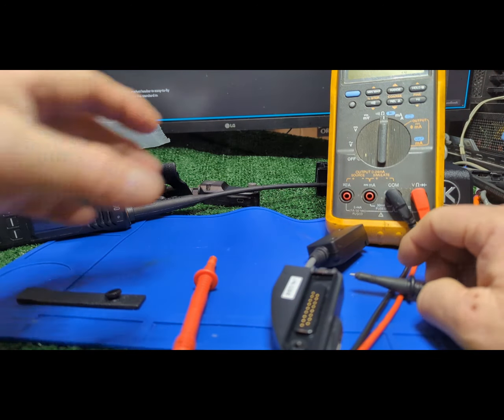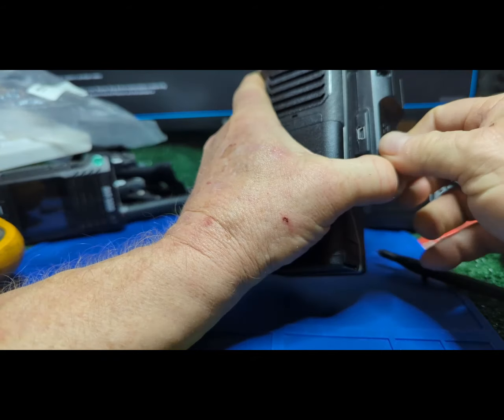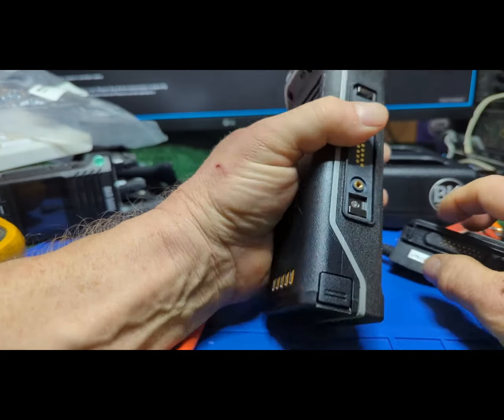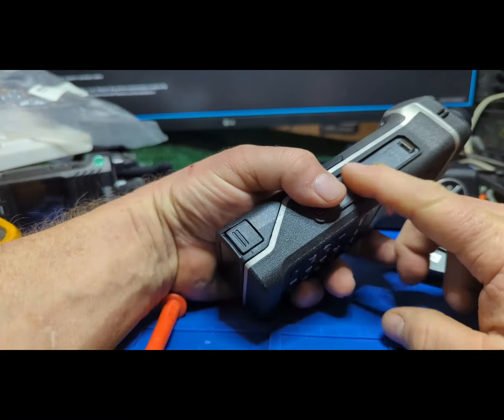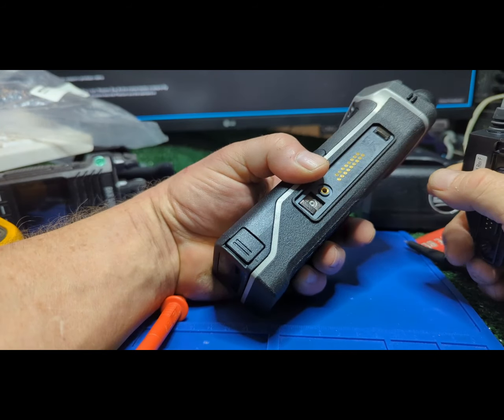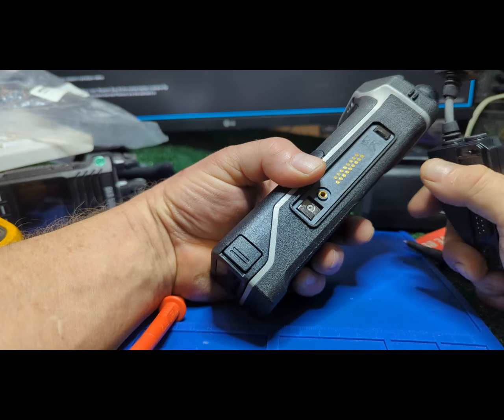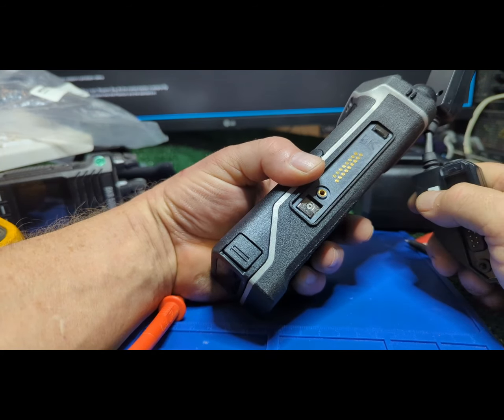I modded all of my dongles, so I don't know if that's been implemented yet, but that's what they said. The reason they do that — it's a good reason actually. If you ever looked at one of the older radios with the cover off, you'd see green on some of these pins. What the mod does — pin 11 to ground — that's a GPIO that actually turns off the side connector voltage until the GPIO pulls it low. There's a very low voltage on pin 11, and when that gets pulled to ground, it turns on all the voltage.